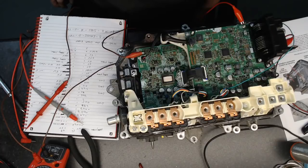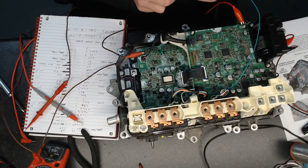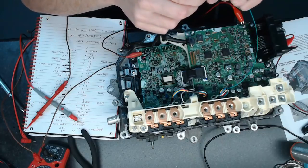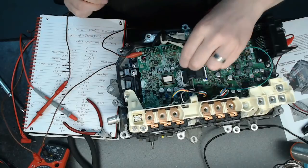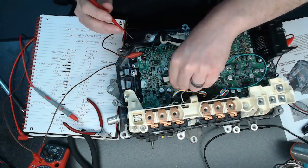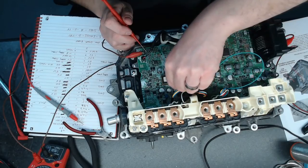Alright. Next. Let's put 5 volts on that pin. Yeah, what could possibly go wrong? We're just going to wedge 5 volts straight into it. Get rid of the resistor. That's for losers. We just want full on. Yep, that caused my current to increase a little bit. Now, that could also be very bad, but let's see here.